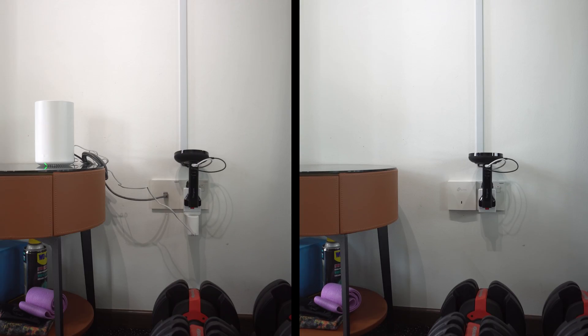Based on the speed test results, you can more or less conclude that mesh will likely give you better performance over AC plus AP using the same budget. So my number one reason to pick AC plus AP is aesthetics — it just looks so much better without cables to the mesh node, and you don't need to find space for it or worry about spoiling the room decoration. AC plus AP is fundamentally an enterprise business solution, so the devices focus more on stability and management. In terms of scale, mesh makes more sense for two or three nodes maximum, while for AC and AP you'd start at three APs minimum and can go up to as many as the AC can support.